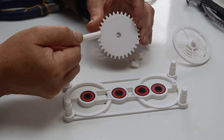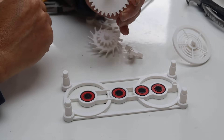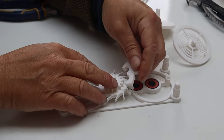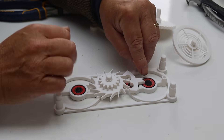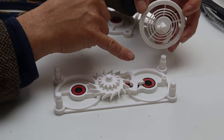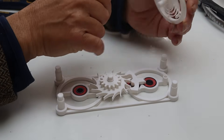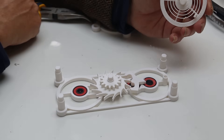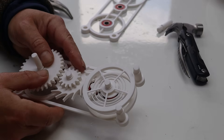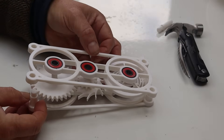The main drive wheel has a separate axle, as does the pallet wheel. It has a lip on it and the lip pushes in so that it's on the flat face of the main drive gear. Then we pop that one in there. We take the selector fork and pop it in there, making sure this little hook faces towards the balance wheel. The balance wheel has a pallet on it that will push that hook backwards and forwards. Then we drop the balance wheel in place, making sure that pallet engages with the fork and the spring pushes into that post. Then we put the main drive gear in so it engages with the gear there, put the top on, and it just slots on and presses onto the uprights.